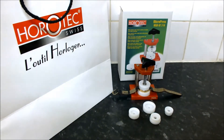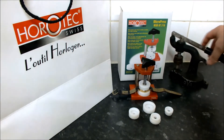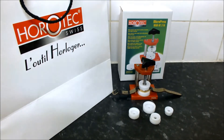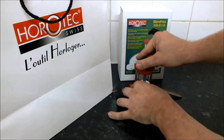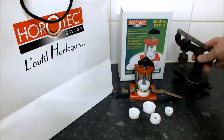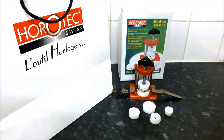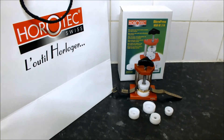There are many lever-type presses available — we have an old one here we use. The fundamental difference between the two styles is the way pressure is applied: you are either screwing it down or levering it down. In my opinion, the lever style tools are better for fitting glasses and crystals, and the threaded tools are better for snap-backs. There are many styles of watch and case so there are always exceptions, but generally speaking we use the threaded type for snap-backs and the lever type for fitting glasses.